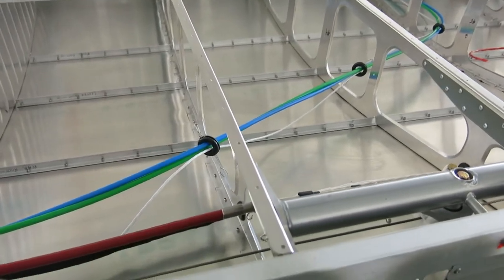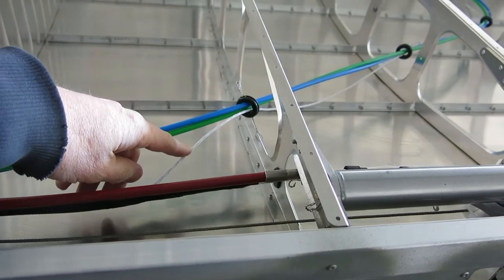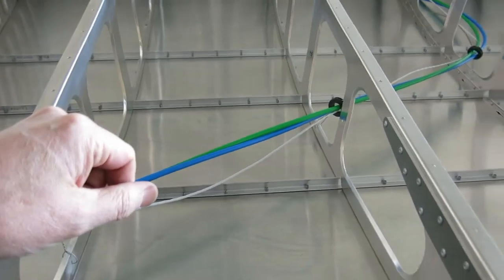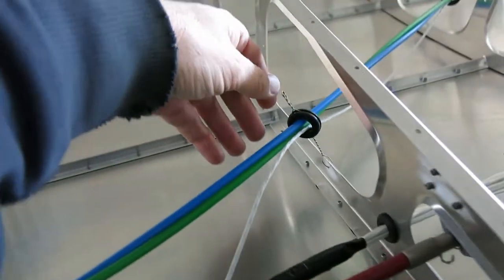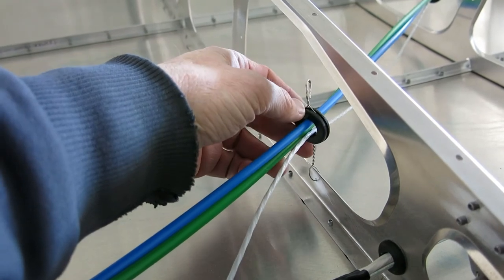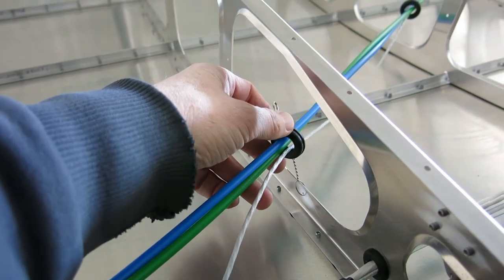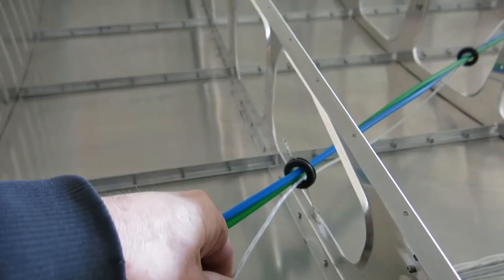So yeah, we've got our OAT temperature probe wire. I've got that running along with the pitot and AOA tubing. Replaced these grommets in here. Those other ones that were in here were pretty small, and they got rounded out and started cracking already. So I just got these grommets in here, just leave them round, and that should keep them in good condition.